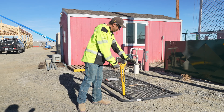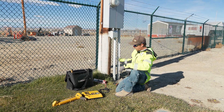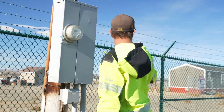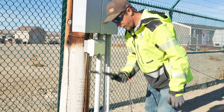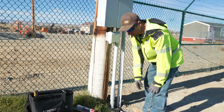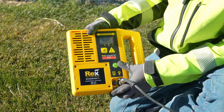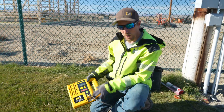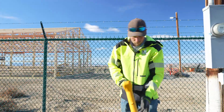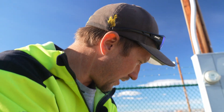That works — there's something metal in this area. Now we're going to go ahead and demonstrate our clamp on this. Outgoing power from the meter to that mobile home — all we're going to do is squeeze it, cause it to go back around that conduit, and gently set it back down on the ground. As soon as we hit the power button on the transmitter, it's going to know exactly what it's doing. It says CLA because it knows it has a clamp attached, so I don't have to do anything. The frequency we're on is 33 kilohertz, so we're going to go ahead and turn our wand onto that — now we're on 33 kilohertz. We match exactly what the frequency is coming off the transmitter.